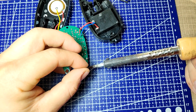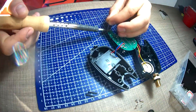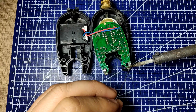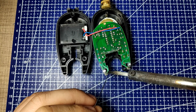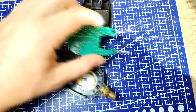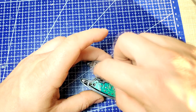We can then insert the new LED in place with the same orientation as before — the longer leg is always the positive, and in my case it's being placed on the right pad on both locations. The tricky part here is getting the length of the legs right. I use the original LEDs to solder the new ones in place at the right height, and then bend the legs outward and down so they can be placed in the original holes.